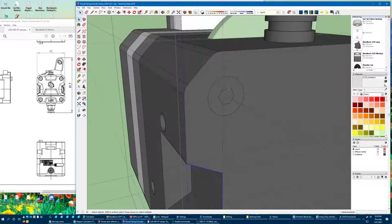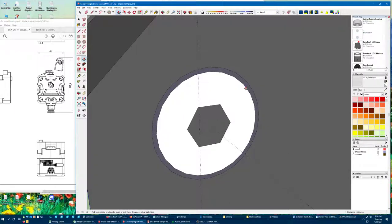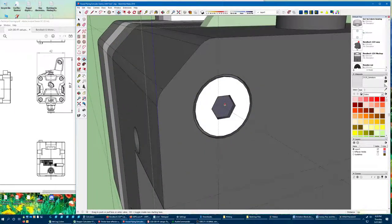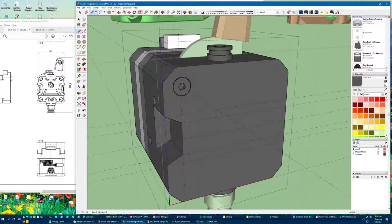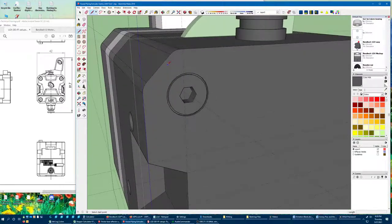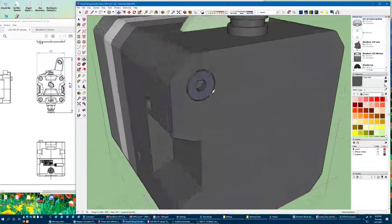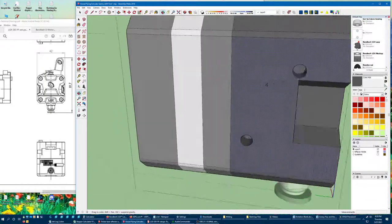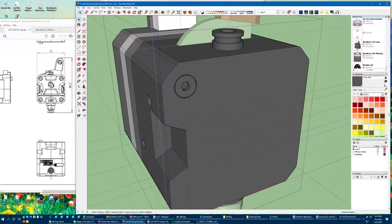There is our bolt head and I'll just put a little gap around that. About how much are they cutting this in at the corner? Looks about two and a half. So what I'm going to do is model one side and one corner here and then rotate it around to repeat my work. A really quick way to do this would be — if this was like a production part I expected to change more, I would probably break this face off into subcomponents. Any geometry you can repeat that way. Of course these aren't all quite the same — it's more like mirrored across that axis.